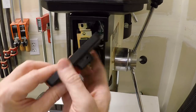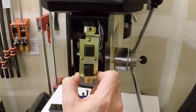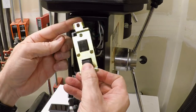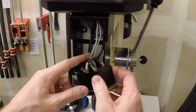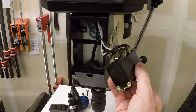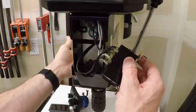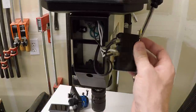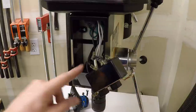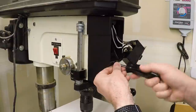These are just push buttons that go over the front of a switch — I have unplugged this so none of it is live. The switch has the wiring and is directly switching the AC wiring for the motor. There's also power for the lamp — there's a light bulb underneath — plus some ground wiring. This housing is held on with three screws.